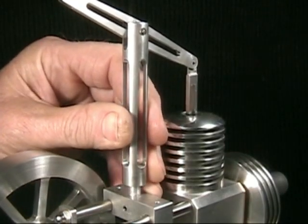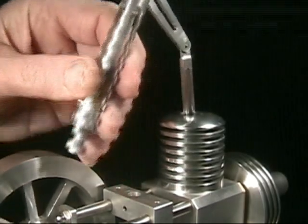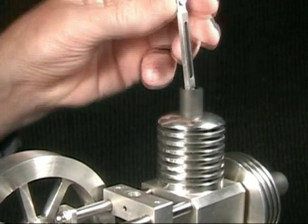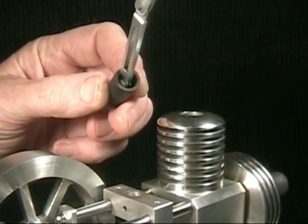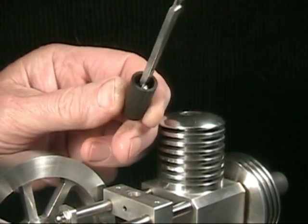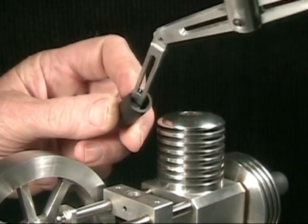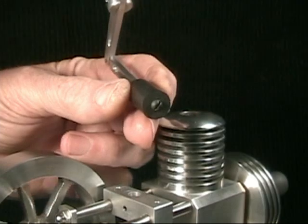Let's have a look at the power piston. I'll remove this column and it lets me pull the piston out of the top. The piston is made from graphite — it's a common EDM electrode material. I seem to have pretty good luck with these graphite pistons. They run pretty smooth, and I think I'll do a little bit better once I anodize the aluminum inside the cylinder.